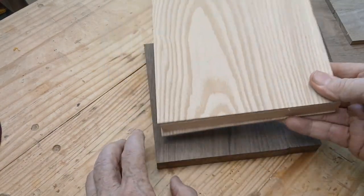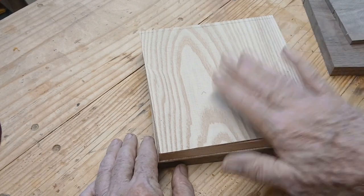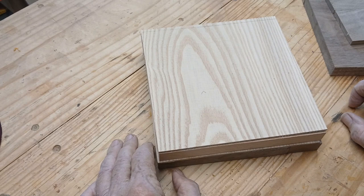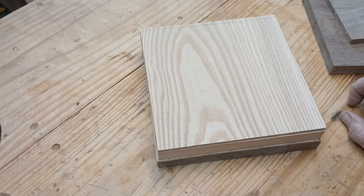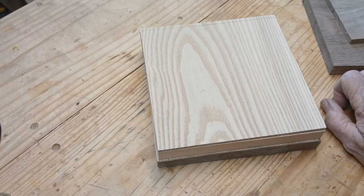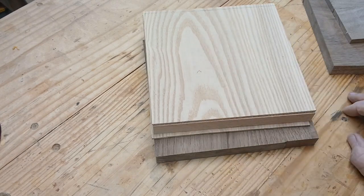I'm going to start by gluing these three pieces together, get the patterns printed out, and get them mounted. First we'll cut the center ring and start working on the top and bottom bowl. We're going to put this together in sections so we can sand the inside. She did this so you could sand it — she has a flexible shaft sander. I have one on a Dremel but not a big flexible shaft for this sort of thing. My sanding is done on the belt sander, belt disc sander, or on the drill press with a couple of different attachments.